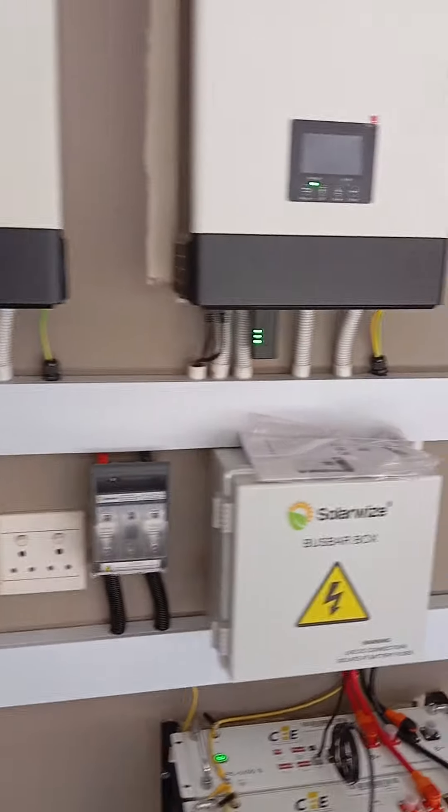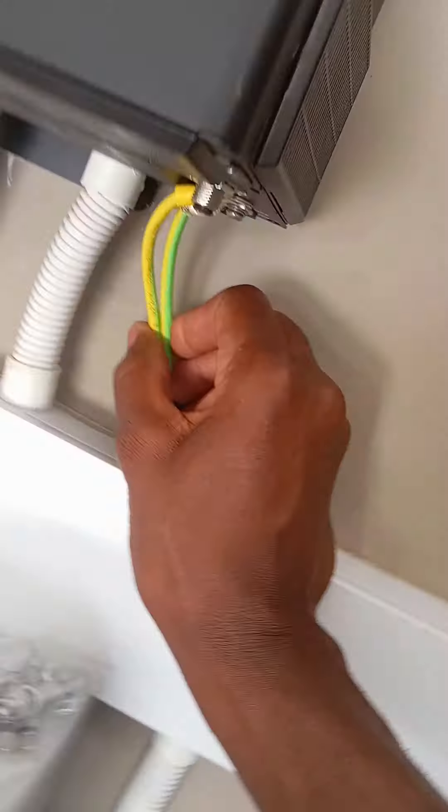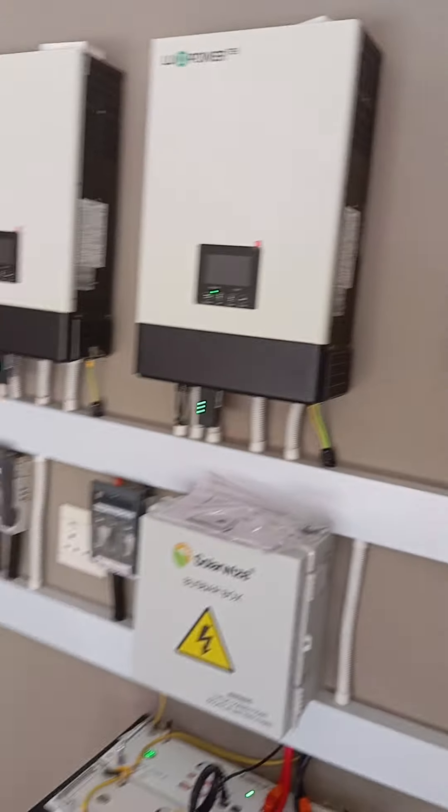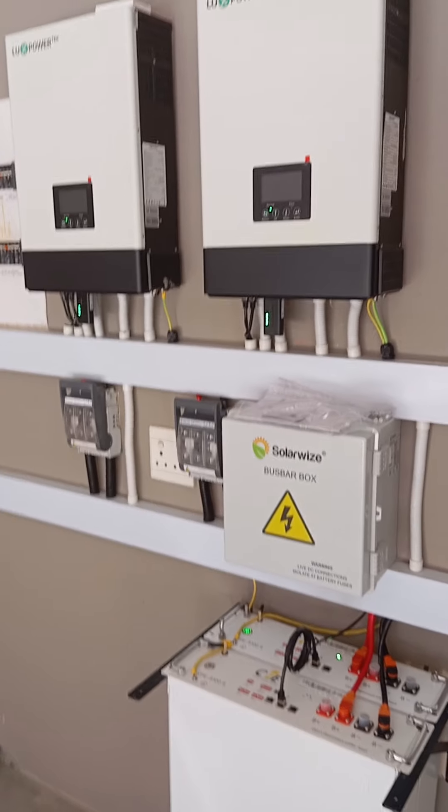It's always exciting to share information. Before I go — we've got our bonding cables here: 6mm bonding cable. Everything related here must be bonded so we have zero potential and nobody gets electrocuted.